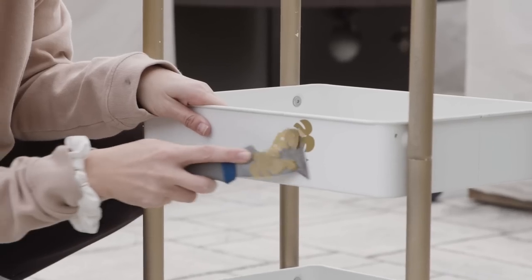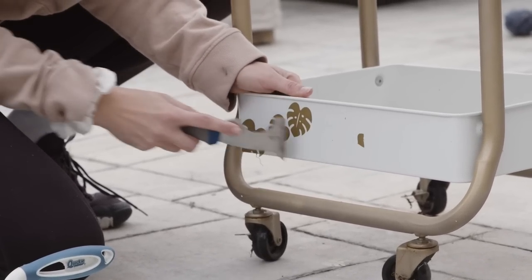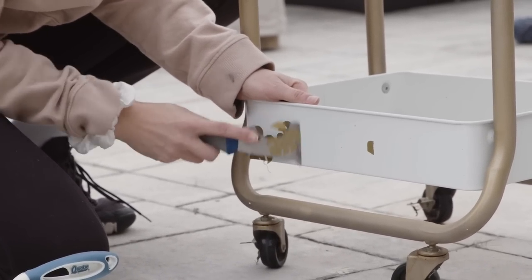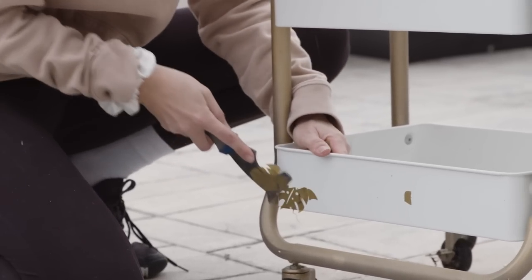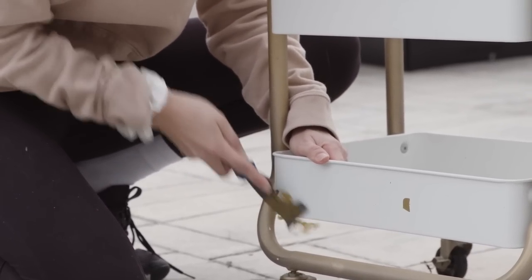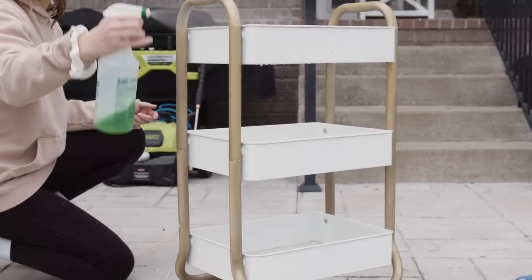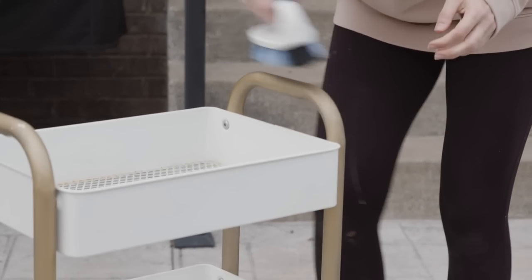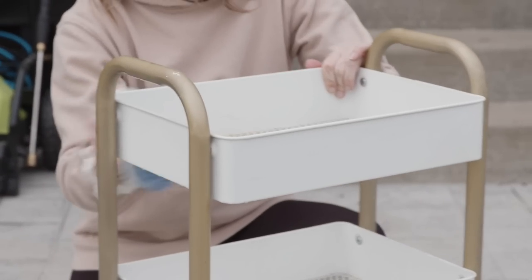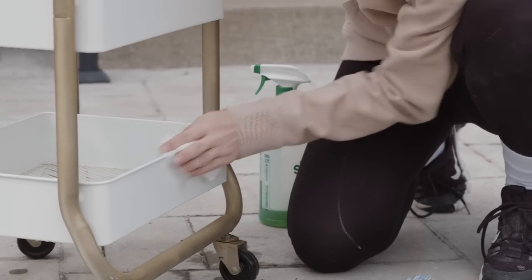This is permanent vinyl and I was surprised how easily it came off — I'm guessing because it's been outdoors for about two years it flaked right off with the paint scraper. When prepping your furniture to paint with Beyond Paint, you want to use an all-purpose degreaser. This is an instance where you don't want to use TSP and you don't want to use soaps when prepping, because those don't work well with this paint. You just want to make sure your surface is clean, dry, and grease-, oil-, and wax-free. An all-purpose cleaner like Simple Green is going to do a great job with that.